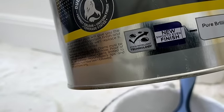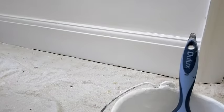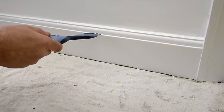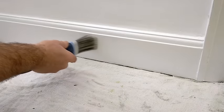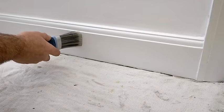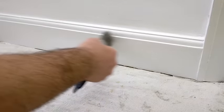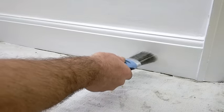Good finish on it. Choose a good paint also to prevent drips on this edge. When you're applying on the face, keep it flat to that edge — don't work in an arc, because paint will also build up and run.